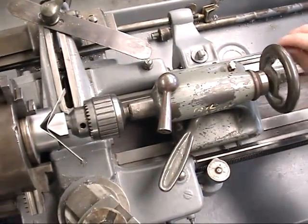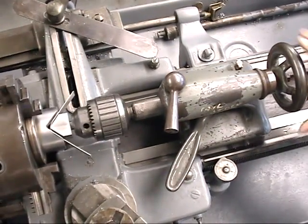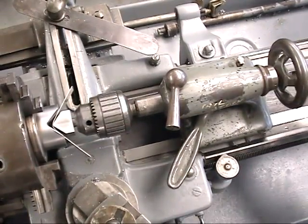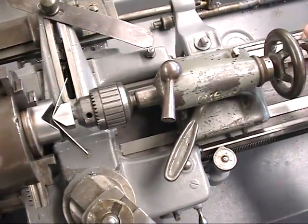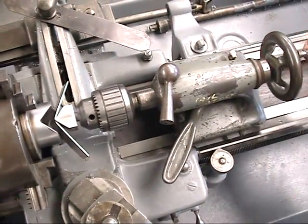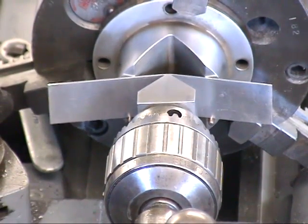Here we see the machine being cycled while forming parts. Notice that when the load is released, the part shows significant springback. We can show that this springback is a function of the thickness, yield stress, elastic modulus, and strain hardening properties of the sheet, as well as the degree of bending.